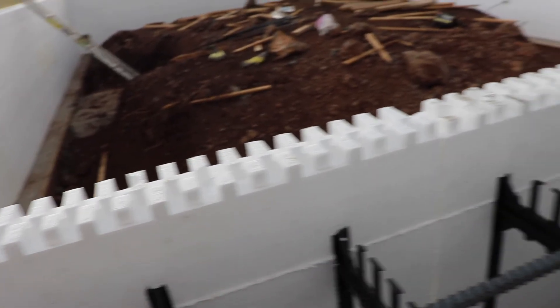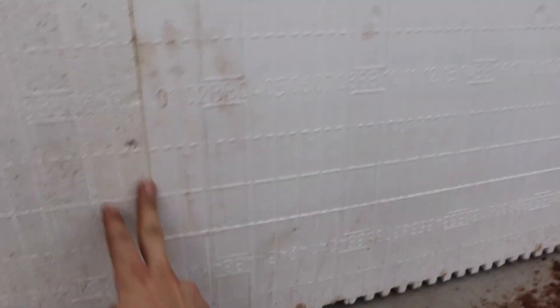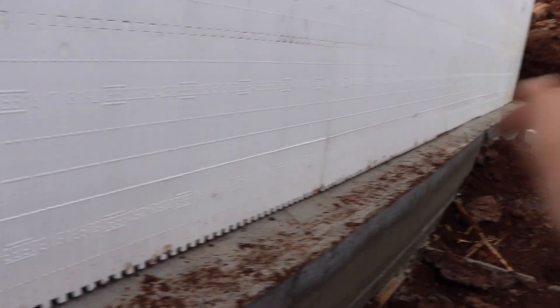Each piece is four foot long and 16 inches high, so this whole wall is four foot high. We had to cut in some places because the corners aren't four foot. You start with a corner piece — this one ends right here. You lay all your blocks out along the perimeter. We had to set rebar in the bottom of them. The next corner piece overlaps so the two pieces will overlap, and then every single one after that just alternates up. Since the corner pieces aren't exactly four foot, you end up having to cut one of the blocks.